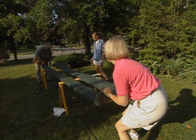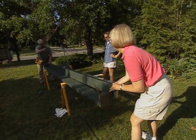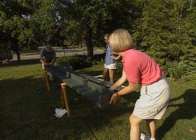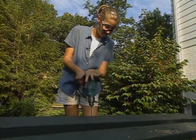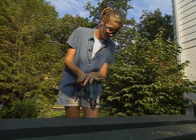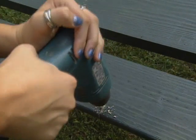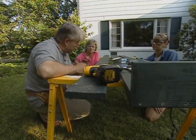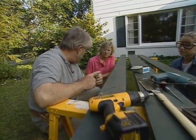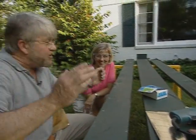Next, we get ready to attach the front and back to the bottom. First, we do a test to make sure that everything fits properly — it should be flush with the end, or pretty close to it. Then we once again pre-drill the holes to allow the screws to go in more easily. Now, rust-proof screws are ideal for planter boxes, but they can be unsightly — I don't want the screw heads to show. The solution? Counter-sinking!